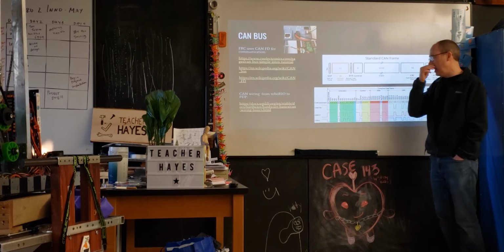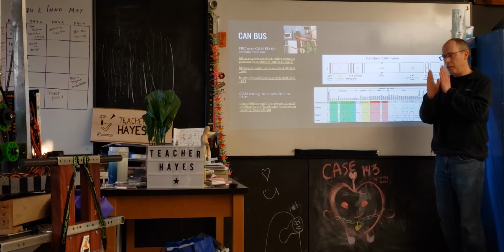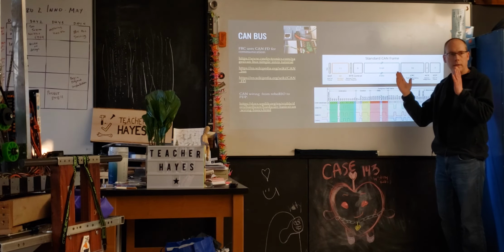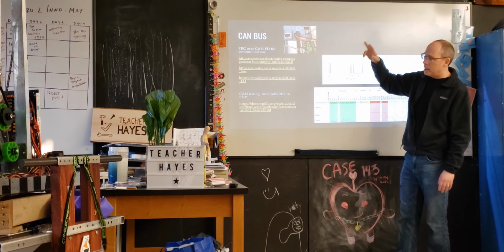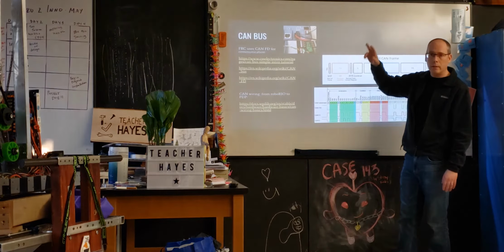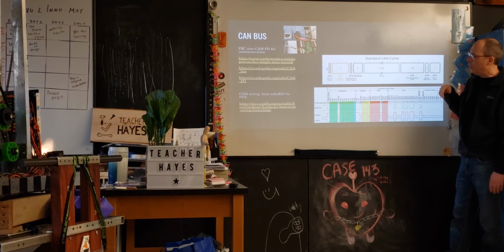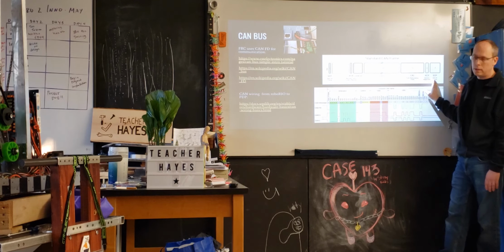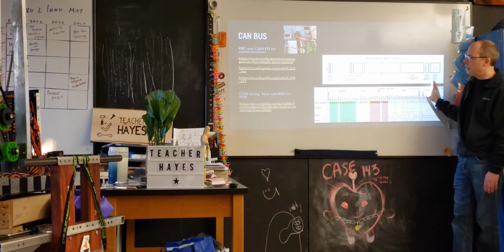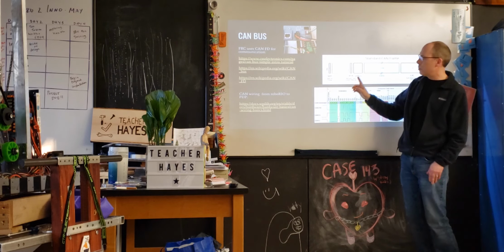So when you refer to the CAN, it's referring to a sequence of ones and zeros that are sent across the wires. So at each of these devices, it can basically toggle them high-low. That's a one or a zero. And then the pattern in which it toggles is specified by the CAN spec, FD in this case. And the way it works is that there's a sequence that is expected by each of the different CAN devices. And that sequence includes specific items.